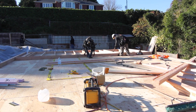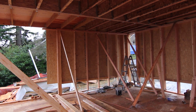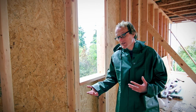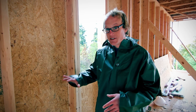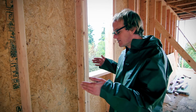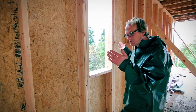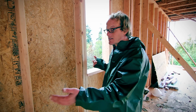Since this is a passive house, the wall assembly is a bit different than conventional framing. One of the primary differences is that we try to keep as much wood out of the wall as possible. All of the wood that's in the wall needs to serve an important structural purpose, because we want to allow as much room as possible for insulation to help attain the R values that are required. Rather than conventional framing, which we generally frame walls at 16 inches on center, we've spread the studs to two feet on center.